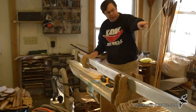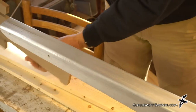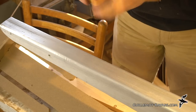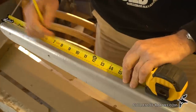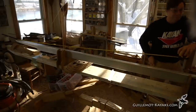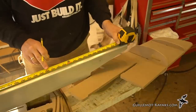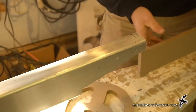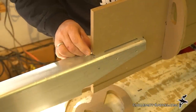When I have this placed in here, I need to measure 140 inches up to the point on the bow form. If I slide the stern form on here I want to mark how far it comes forward — right there. Measuring from that point, that is 9 and 3/8 inches. So now sliding down to the other end, I want 140 inches but I'm measuring from the far end of the strong back which was 9 and 3/8, so we'll go to 149 and 3/8. That's where I want the end form to line up.